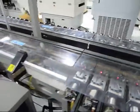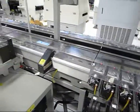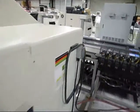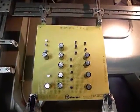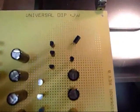We can watch some action back here first as it loads up the carrier clips. Here come the first components. It'll be up to the head soon and inserting shortly. You'll notice that the head rotated to all angles and inserted two-legged and three-legged components. Let me pull one out right here — you can see there's a three-legged component, and there are electrolytic capacitors that are put in.